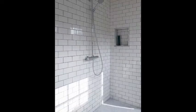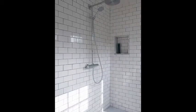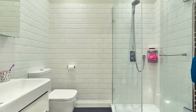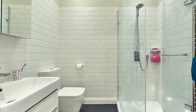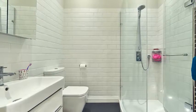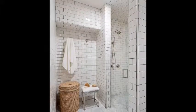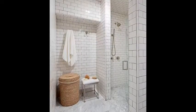Trowel some thinset onto the back of the tile and spread it with a notched trowel. This process is called back-buttering, and it's usually more effective than troweling the mortar directly onto the back of the board and then setting the tiles on top of that. It's also a lot cleaner. Be sure not to apply too much mortar to the back of a tile — a thin, even layer of mortar is best. More isn't necessarily merrier when it comes to thinset. Set the first tile in the middle of the wall or floor; this will create a pleasant visual effect and allow each tile placed beside it on either side to appear centered. After back-buttering, simply press the tile onto the backer board and apply pressure to make sure that the mortar adheres properly. Wipe away any excess thinset mortar after pressing the tile into place.